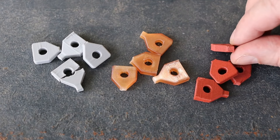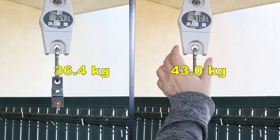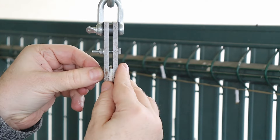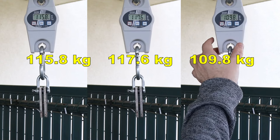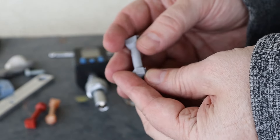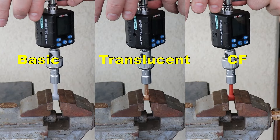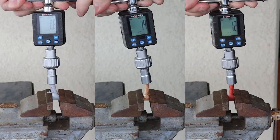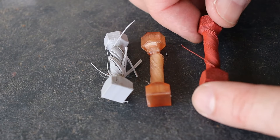Since I got quite different results with the translucent, I decided to reprint and repeat those objects — I have two test objects and will calculate the average value. Now the shear stress test: side by side all three objects show very similar break load in all three cases. One part from translucent I couldn't find. Now the torque or twist test — this object is 60 mm in diameter and I want to record the load at 90 degree angle and the maximum load. Side by side all three objects show quite big differences in these loads at 90 degree angle. Interesting break, especially with the basic — I am a little bit confused why it broke in so many pieces.